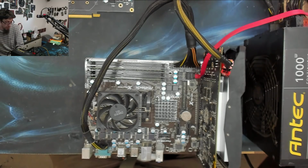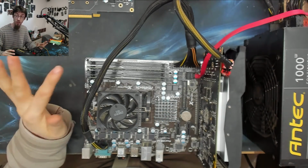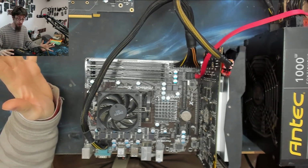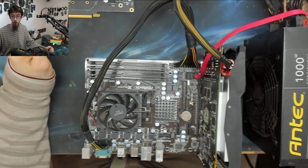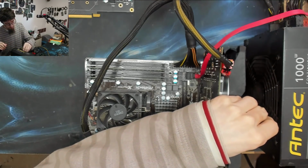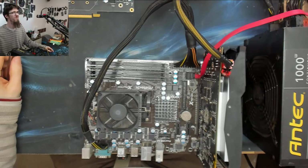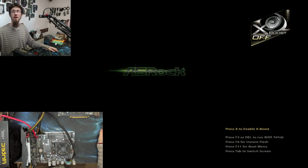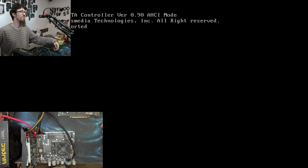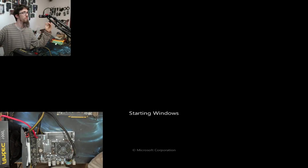So, first of all, we couldn't get one to work in Windows 10. The drivers just wouldn't take. You install the driver and it would say, yes, there's an NVIDIA graphics card there, but it would constantly throw up driver errors. Code 43. Basically, the error message was just that the device has reported an error. It was really unhelpful, wasn't it? We were just like, who knows what that is? Very much a case of, this might be working, this might be actually just hardware faulty. The driver might just go, this is the incorrect region. We didn't have a particular avenue to investigate initially.